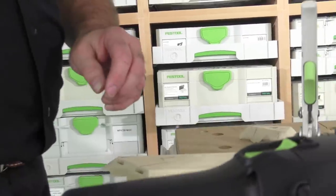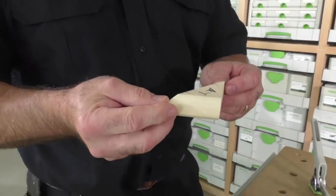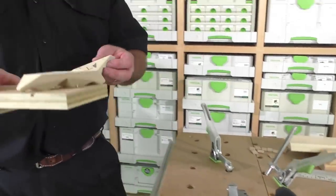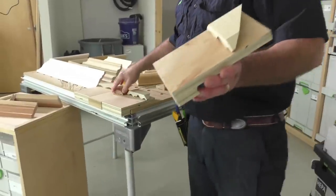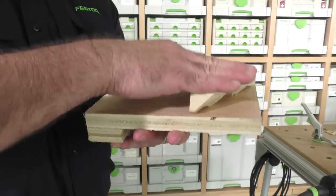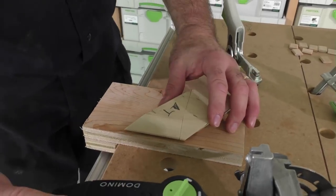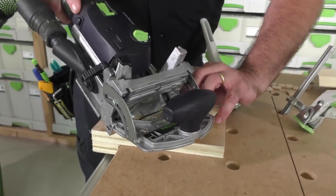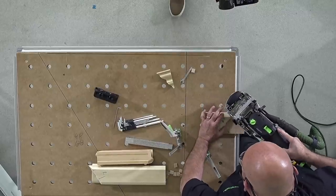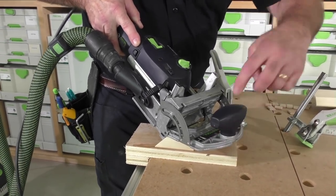On that, we have a little bit of wiggle room — about three millimeters on each side — so it will help when we're setting up the glue. Now think about this — do I have any place to clamp this? I don't. So what I'm going to do, we're going to be doing these in a tight setting. I built a base where the plate can safely lie while I'm doing that small piece — a traditional bench hook, so I could take that, bring it in just like this. So now I'm just going to do this molding just like this, making sure I get my thumb right on there where I need to be. And then I'll come over here and grab this one. Now I have the support of that molding off-cut.